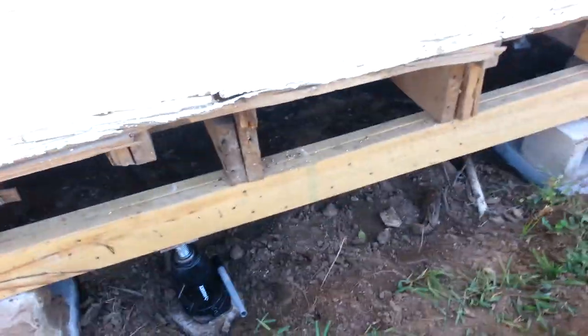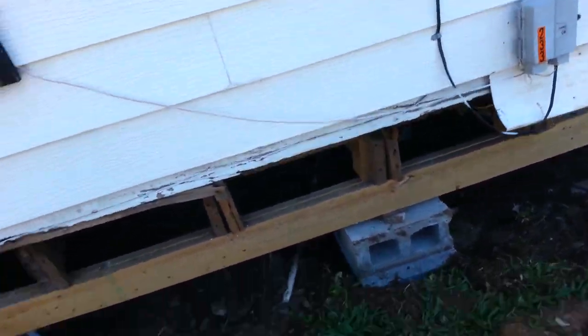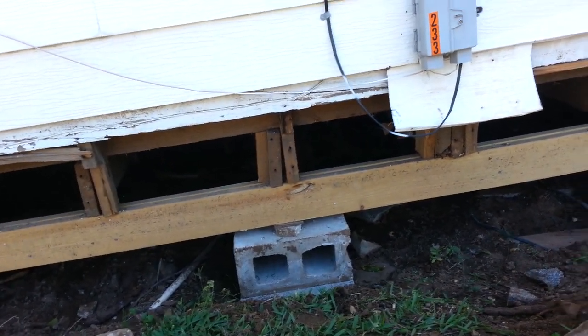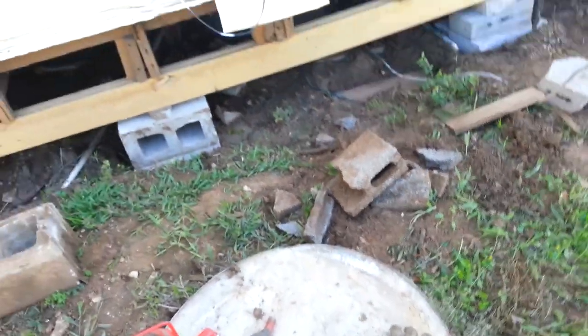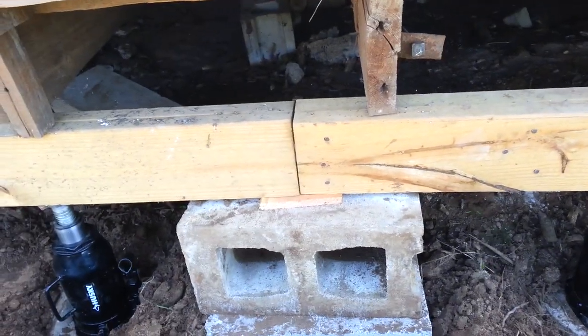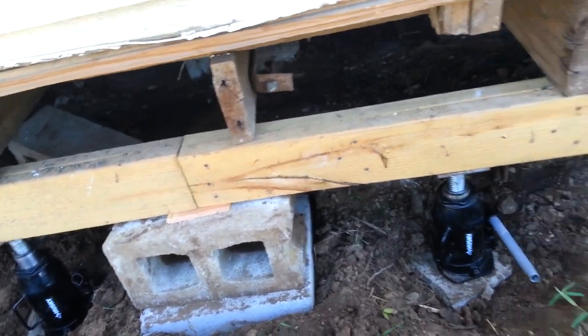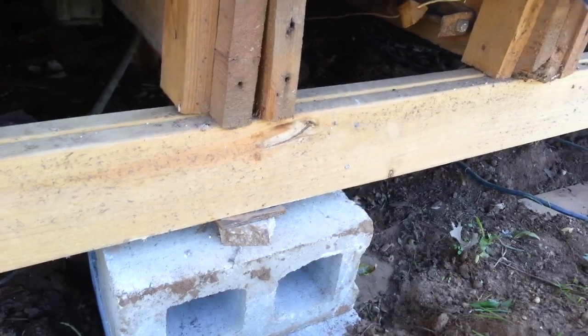I just get these at Home Depot. When you actually jack the beams up, you want to put these quarter-inch pieces of steel on top of the jack so that the top of the jack doesn't punch a hole in the pier — these will destroy the piers. You've got to distribute that weight out, so set this on top and then lift. We need something between the concrete and the beams because they can serve as highways for termites. I just get cedar fence posts at Home Depot, cut them up, and termites don't like cedar. So I put it between the beams and the cinder blocks.